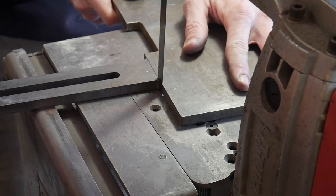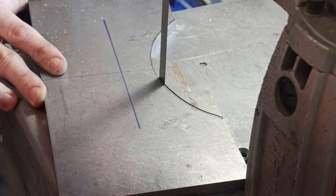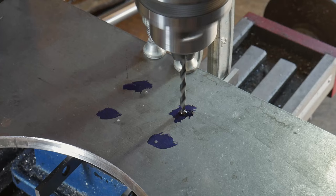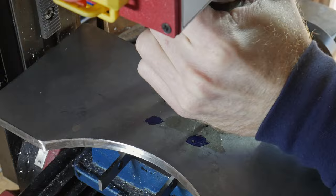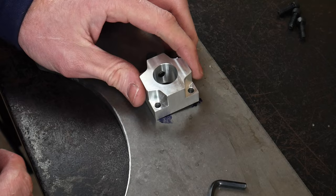In this section we will be fabricating a work rest for an 8 inch contact wheel in the horizontal position. I had a standard Origin Blademakers work rest that I figured would be nice to repurpose for this grinder. First thing I did was measure out the center lines both horizontally and lengthwise on this work rest and then cut out the rough shape of my wheel. I then used the wheel itself to clean up my cuts and got on to drilling the holes required to mount my mounting bracket. I drilled four holes three quarters of the way through the work rest and then tapped these holes to accept the mounting bracket hardware.